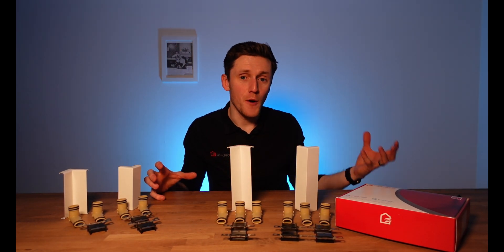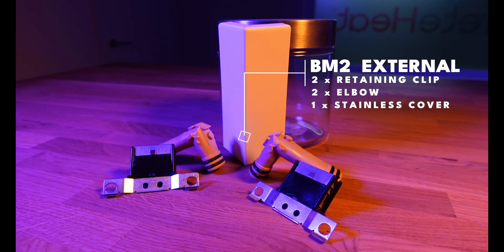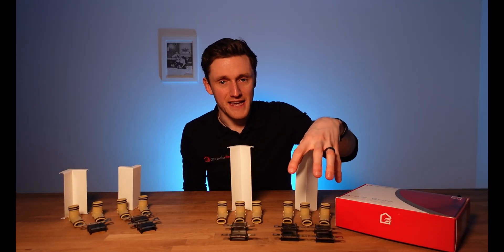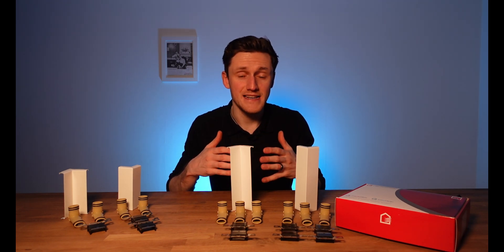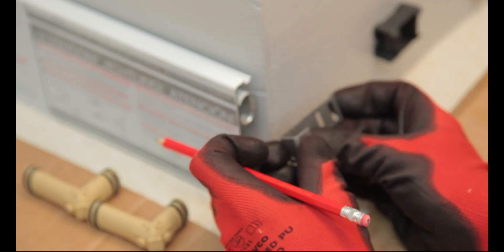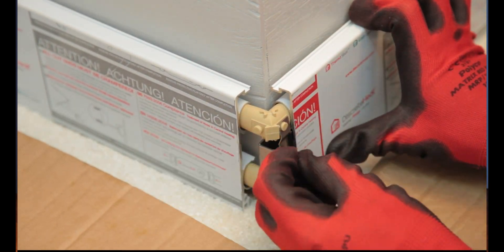All lengths are retained at the opposite end, and because the fitting is in an internal corner of the room it can't go anywhere, so you won't get any blow-offs. The external 90 corner kit on the Deco BM2 has two clips, two elbows, and one prefabricated corner cover; on the BM3 it has four clips, three elbows, and one prefabricated corner cover. The external corner kit has twice as many clips because on an external bend there's nowhere to lock in the skirting, so the clips fix it in place. You also get an anchor bracket included in every external corner kit — use this to make sure the skirting doesn't move a millimetre once you've pressurised the system.